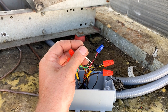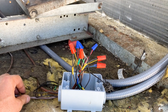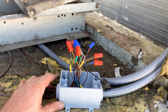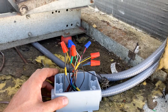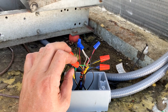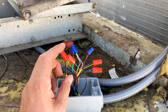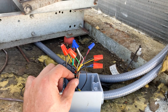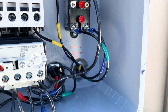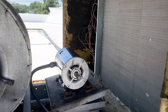As far as I know this is single stage, but interestingly, white was hooked up from the condenser to the thermostat. One of these wires comes from the condenser where the transformer is located, and one goes to the thermostat. We have our float switch tied in, breaking red — that's how it was before. We have green going to 600-volt rated wire into our motor starter enclosure, same deal with yellows and blue which is common. Everything's labeled, and I have it labeled that that's low voltage coming in.